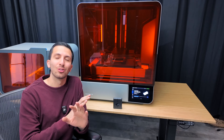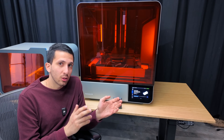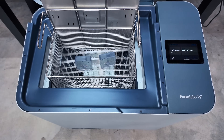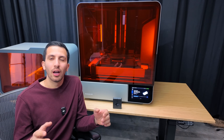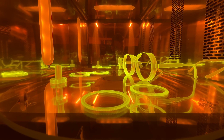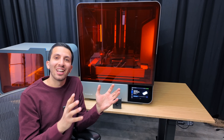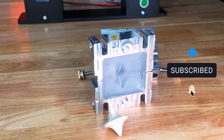The printer is worth the hype — it's definitely much better than a conventional FDM printer, granted far more expensive. The process is also more time consuming than FDM since you have to wash with isopropyl alcohol, which is quite expensive on this big printer given the volume of IPA needed. However, the washing station is very well engineered and makes the task much easier than other resin printers I've used. The heated, large cure chamber properly cures parts with UV light and heating, which is essential for applications like injection molds needing fine detail. We're excited to try more resins and projects with this printer — subscribe and we'll see you next time.